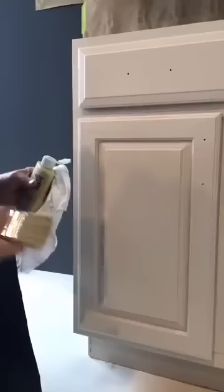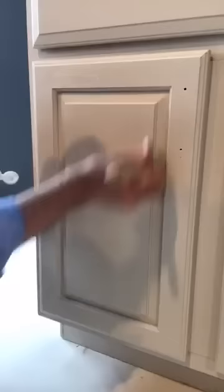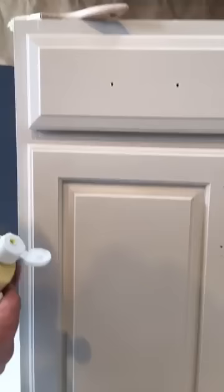Now, you're getting ready to do the inside with your brush. I'm just going to put a little on the brush. Oh, I love that. Just a little bit there on the tips. That's awesome. And it's not changing the color at all. Now, as a rule, a lot of people don't realize, but with furniture from years ago, and especially a lot of the really fine antiques, they didn't use some of the lacquers and the shellacs and the solvent-based products that the manufacturers do nowadays. So this natural beeswax is going to dry to a really beautiful, hard surface.